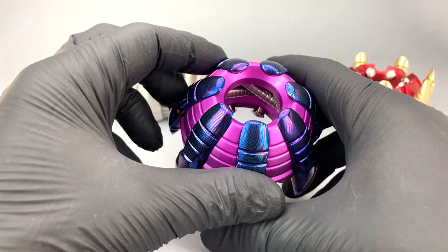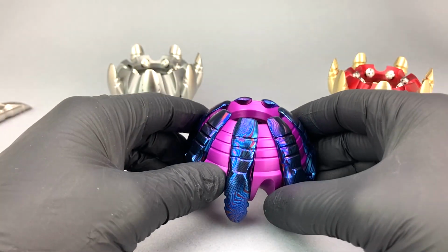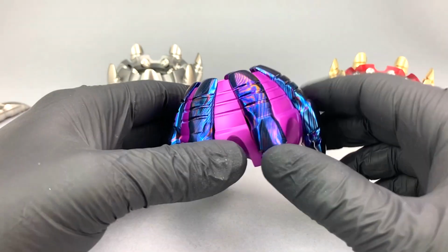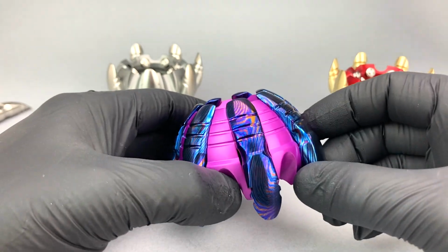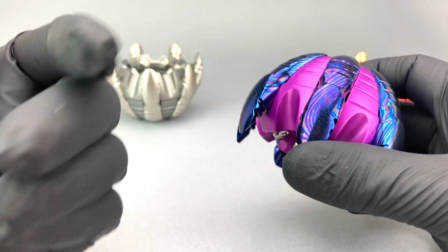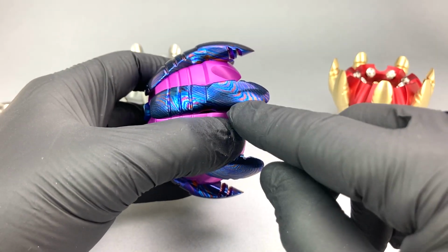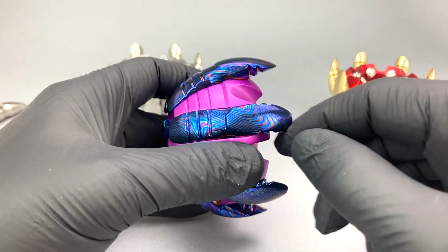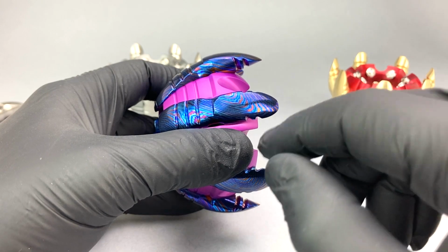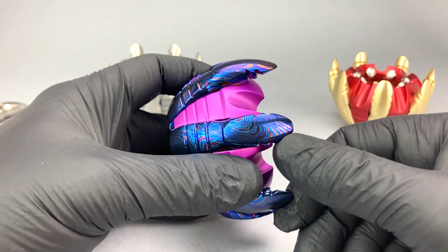I didn't know this, and it was sort of fascinating to me. I'm not quite sure of the science on this, but you can anodize titanium electrochemically. You can just stick it in an anodizing tank with the right current, and it will anodize blue and yellow, or actually there's quite a wide range of colors. When you heat treat this, the titanium Damascus is made of several different alloys of titanium so that they react with the flame differently. So they self-heat anodize at a different rate, and that's how you get the differentiation in colors.